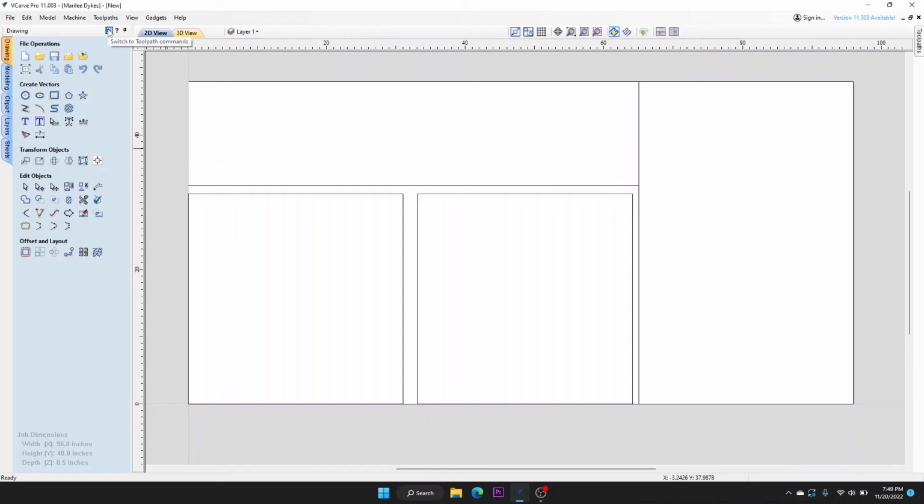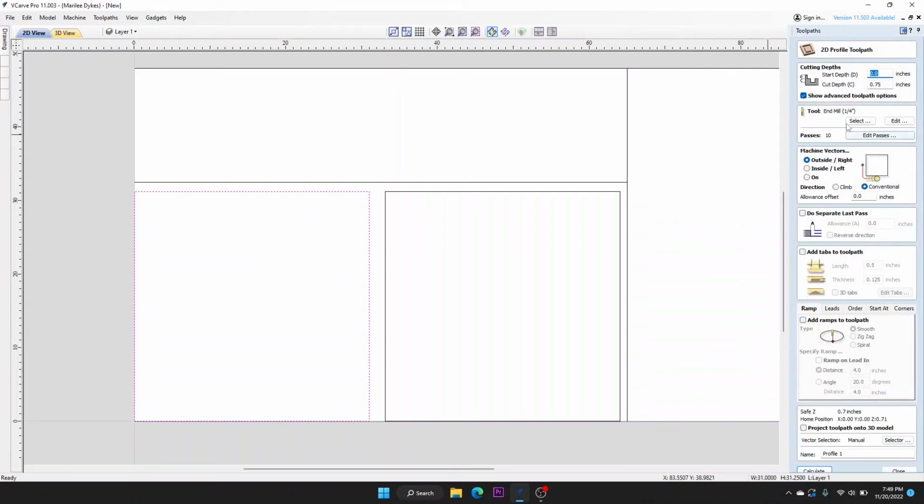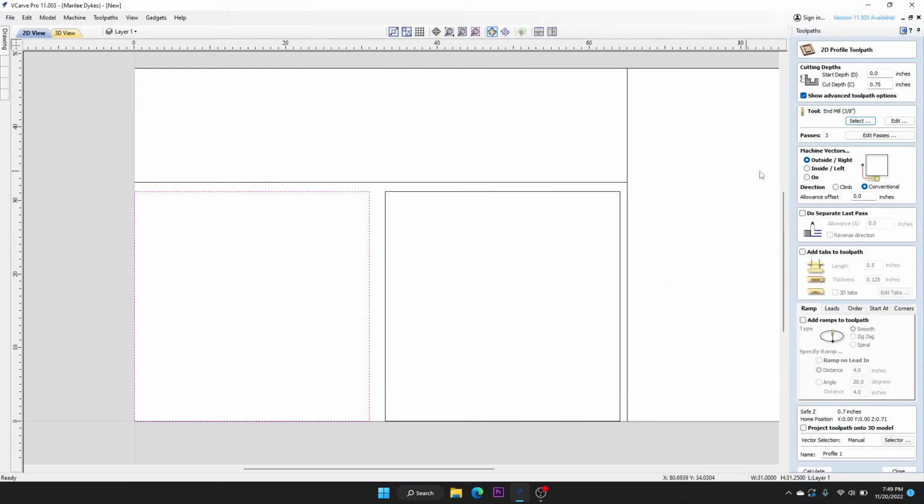We're going to go over here to the little blue arrow and switch to tool paths. First, we're going to click this line, that vector, and come to profile toolpath. Your tool library is going to be very different from mine, so you might not be able to follow me directly, depending on how yours is set up. I have a 3/8 compression tool that I use to do all my cutouts, so on this particular one, that's what we're going to assign. We're going to do outside, so the tool is going outside of that vector, and we'll just leave it as profile 1.